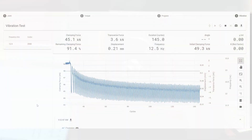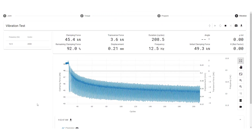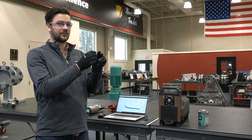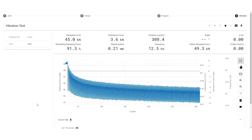As you can see, there is an initial drop off in load. That is due to the nut rotating ever so slightly, shifting into place, and locking into the top side knurls. That is what prevents it from continuing to rotate off. Once it gets locked in place, you can see on the graph that everything levels out and we are good.